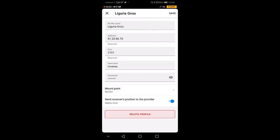Basically, here we have a name for the profile. We have an IP address, which is the address from where the correction data is being broadcasted. We have a port, usually for GNSS data it is 2101, but it may change according to which service you're using. And then we have a username and password, which I got from the regional authorities when I subscribed to the service. Sometimes you have to pay to get this username and password, depending on which service you use.